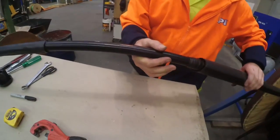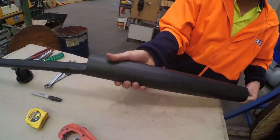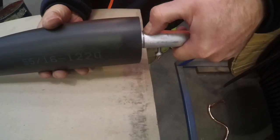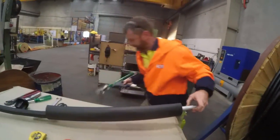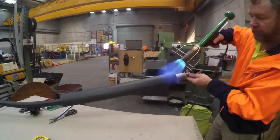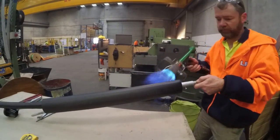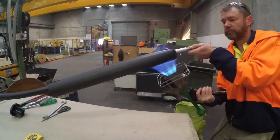Place the second 600mm heat shrink tube into place over the cable, again ensuring that the semiconductive tape is not damaged, overlapping the previous heat shrink tube by approximately 6 cm. Shrink about 7 cm of the upper end of the heat shrink into place so that it will sit flush with the base of the plastic mast butt adapter when fitted into place. There is a mark on the lower finial connector indicating where the heat shrink needs to be fitted to.